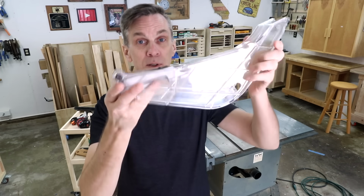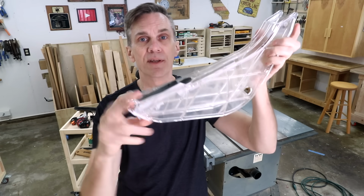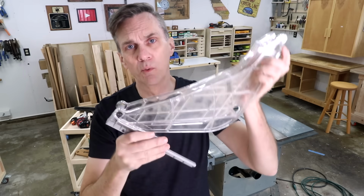Your saw will come with a blade guard, maybe similar to this one. As a new woodworker, use it. It's there to prevent wood from dropping on the blade or your hand from skimming across it. That said, I rarely use one myself. I've laid out my specific reasons in a separate video called Why Do So Many People Remove Their Table Saw Blade Guards? Click on the link in the description. Again, as a new woodworker, you should use every safety accessory that comes with your saw.